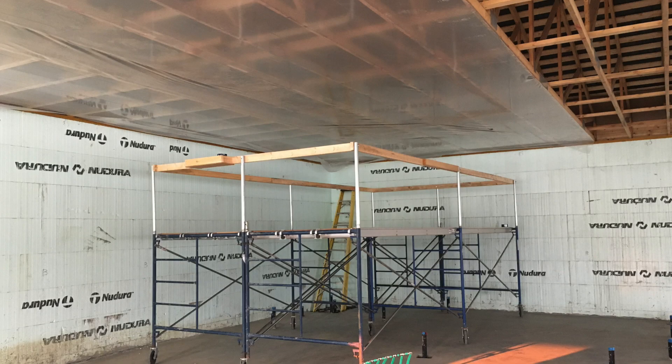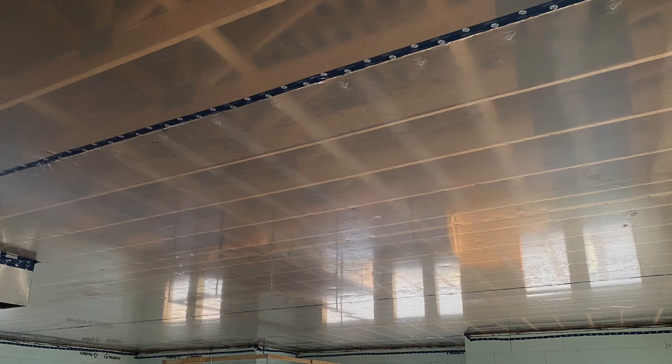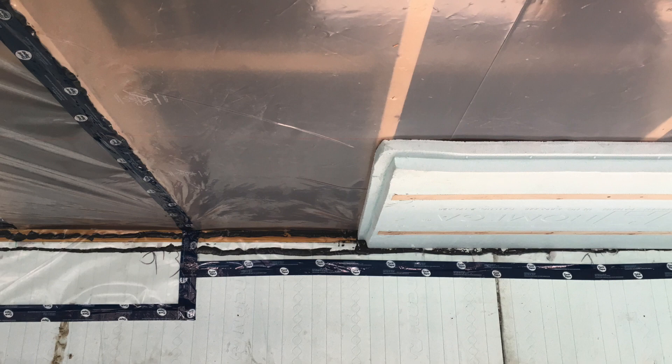When you're ready to do your vapor barrier on your ceiling or on the underside of your trusses, just do a good job and pay attention to the details. Same as the slab — take the vapor barrier, fold it down over the walls, do acoustical sealant at the top plate where the ICF meets, and then tuck tape it. That's really just to stop the poly from getting torn or folded funny when you're boarding. Always make sure your vapor barrier is on positive backing — you never rely on an overlap just loosely flapping. You need an overlap on wood solid backing, acoustical seal, and a proper overlap so when the drywall goes on and squishes it, it makes it airtight.